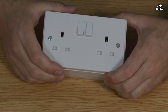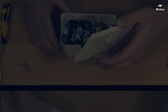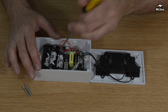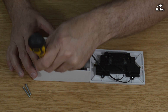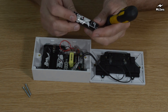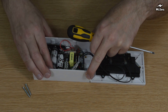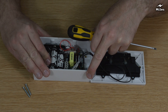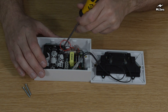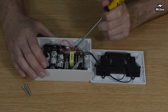Let's open it up and have a look inside. So inside you can see three of these lithium-ion 18650 batteries, and they are literally just the standard ones. I've got vaping ones because they're pretty good on power delivery — I prefer the vaping batteries, even though I'm not on vaping myself. There's three of those, and they produce approximately 12 volts, maybe a bit less. These run from the battery holder to that switch that I showed you on the back. I've just sealed it up there with my hot glue gun.